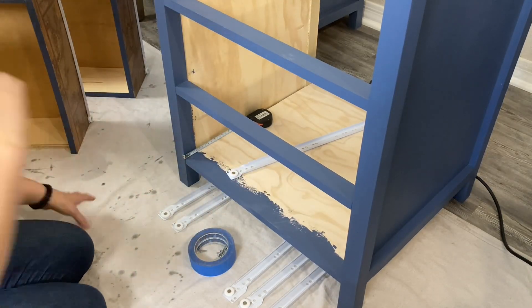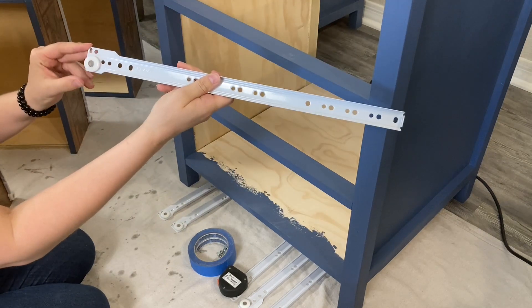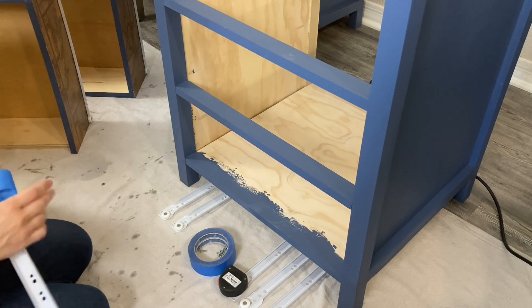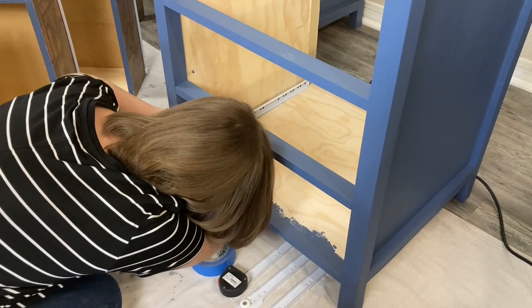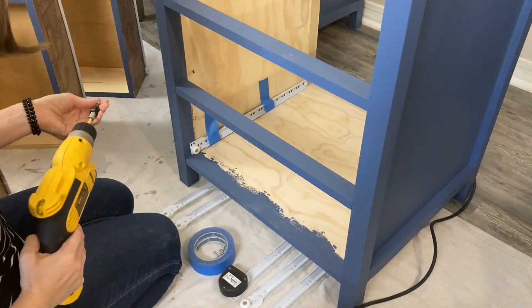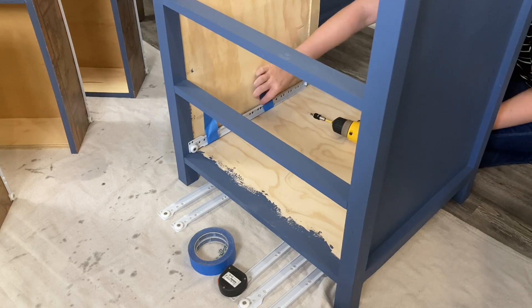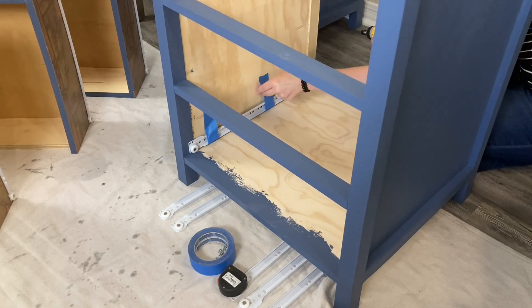I'll just align them vertically once the drawers are installed. Install the first screw just behind that front wheel, then the next screw at the back of the slide, being sure to check that this cabinet slide is level. Install the middle one last, and make sure that you don't cause the slide to bow. I want to pause here and note that I'm using tape to hold the cabinet slide at the distance and height I want it. This is a great option for solo crafters to keep your hands free for repositioning things and installing the screws.